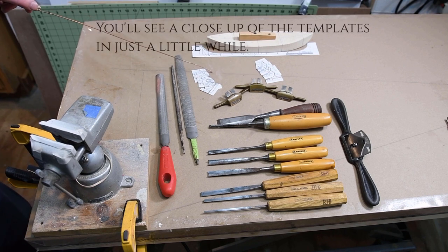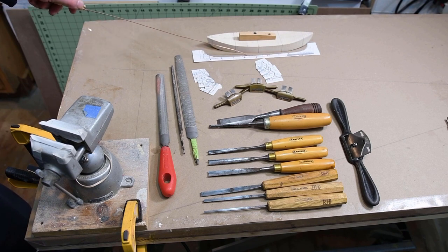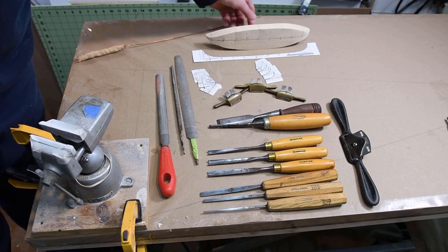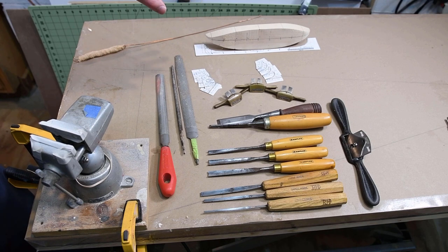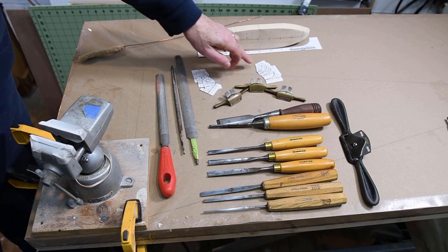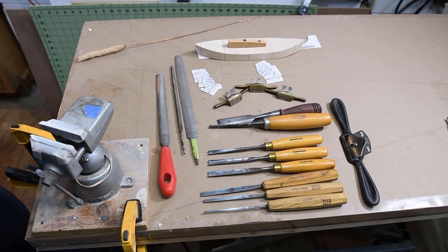It's very important to have an accurate set of templates. I made these by making multiple copies of the plans, gluing them onto a piece of bristol board, and carefully cutting them out. The keel template is used to make sure I have the proper amount of sweep on the bottom of the blank. I've already done that off-camera — you put the template up to the blank, see where it's making contact, and those are the spots that need material removed. You just keep removing material and trying the template until there is little to no daylight left. Once you've gotten to that point, you know you've got the shape right.